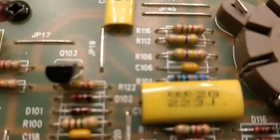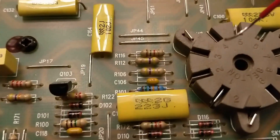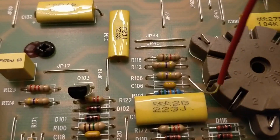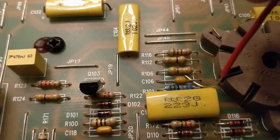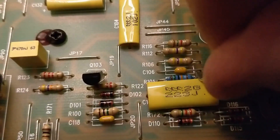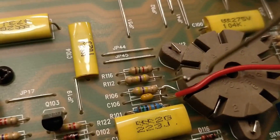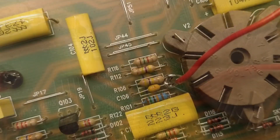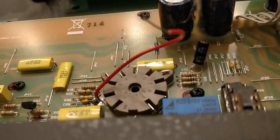On the clean channel, middle and base, now we're going to go up and over. The area that you're going to be looking at is these two leads, the C106 and the R106. I just looped the lead wire right under the two legs of this resistor. We're going to hit it with some solder and we're going to snip off this piece right here. Now that the solder is together, I'll snip off the excess on the lead and we'll hook this end of the red lead to the switch.